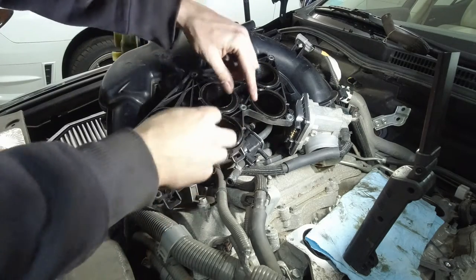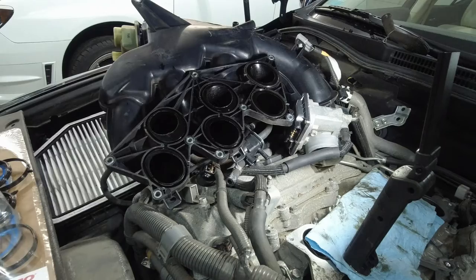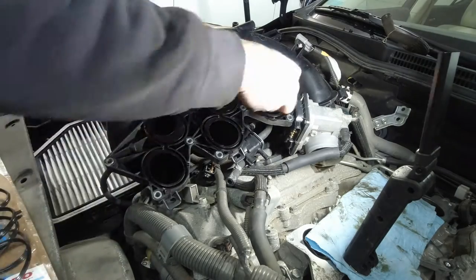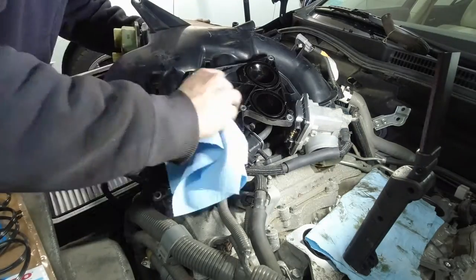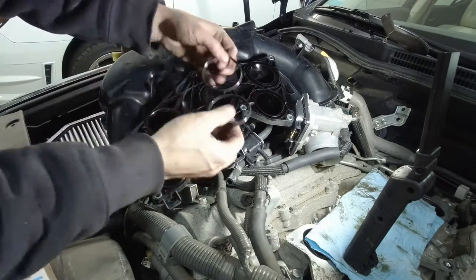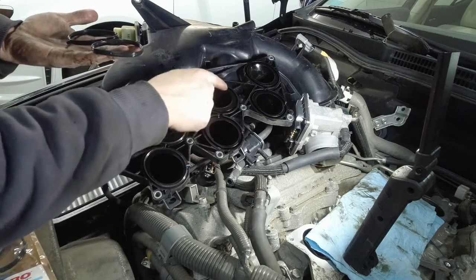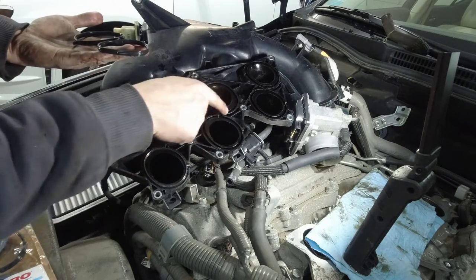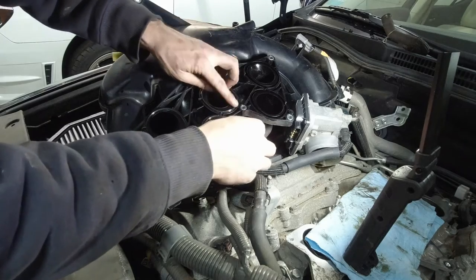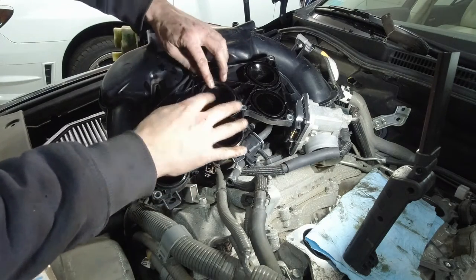You could probably get away without replacing these seals - the rubber isn't super soft anymore, but why risk it? I just noticed these actually matter in the way they are shaped. See, this one is kind of almost like an egg - this part is more round, this side is more flat. This one fitted perfectly. Let's see what happens if I flip it - this one seems too big for this side and this I need to stretch. So pay attention to the orientation.